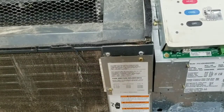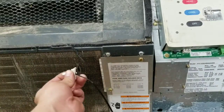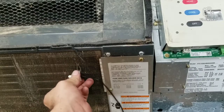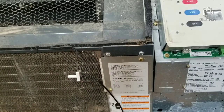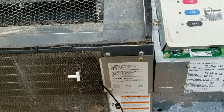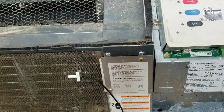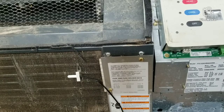Just make sure that your thermistor is sitting in the right position where it can read the temperature of the return air, or that unit is not going to come on because it's just reading the temperature of wherever that sensor is — either inserted in the coil, or if it's in the drain pan, it's going to be reading the temperature of the water. So no matter how low you set that unit to, it's not going to come on because that sensor is reading the coil or the water instead of the return air.